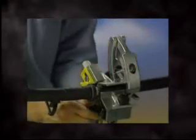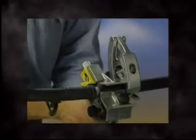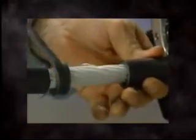Once the desired length of strip is reached, turn the tool into a gloved hand or Ripley's quick clamp. Loosen the locking knob, depress the trigger, and remove the tool. The same basic operation applies to single covering cables and secondary voltage cables.